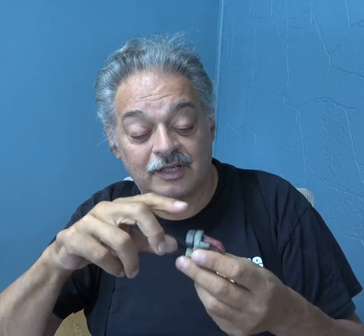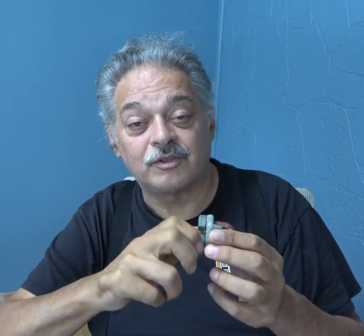There's no controversy as to how many wire rope clips you use when you do a turn back eye and where they go. The manufacturers of these clips publish where these clips should be located, how many, and how many foot pounds you're going to exert on these nuts to tighten the bow down. You want to stay within their confines. You don't want to over crush the rope, leading to broken strands, and you don't want to under crush the rope because the rope could potentially slip through.